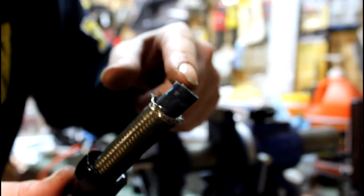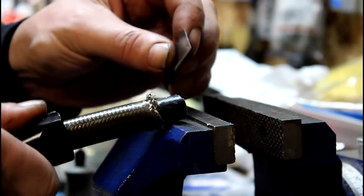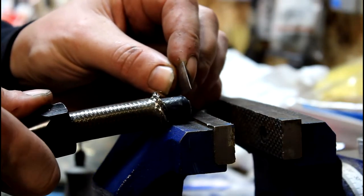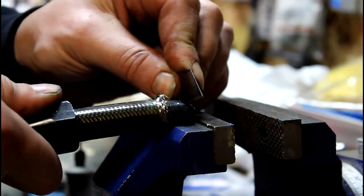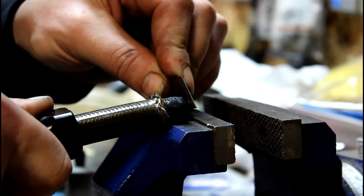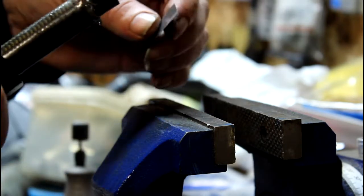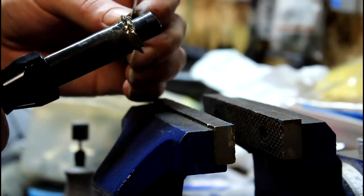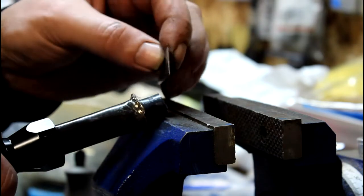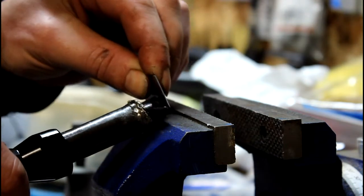Then you want to make sure the end of your PTFE is nice and flat. I just take it and trim it nice and even. If you get a nice sharp razor blade, it will cut right through it. Just work your way around and cut off any high spots wherever they may be.